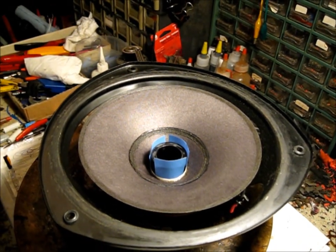We've got it shimmed so we're centered. Now take a look in here — you can see the aluminum rod that connects to the other woofer. When you go back in, you have to put it back together in reverse order. If you put the bottom woofer in first and then try to put the top woofer in and connect the rod, you'll never be able to do it. So we put the top woofer in first, then the connecting rod, then the bottom woofer, and then the final bolt.